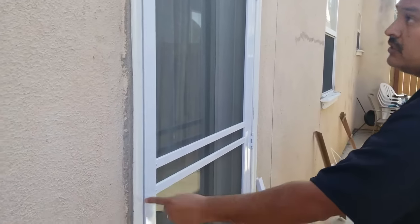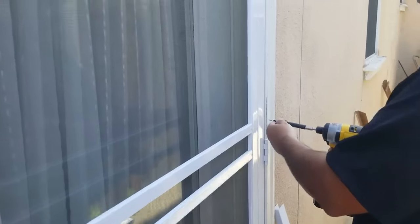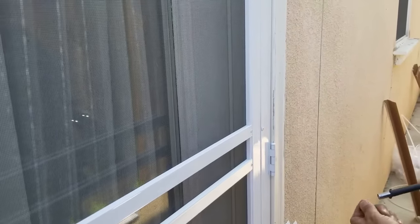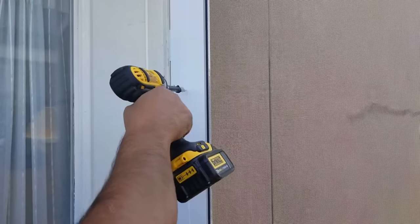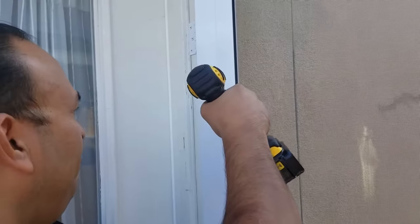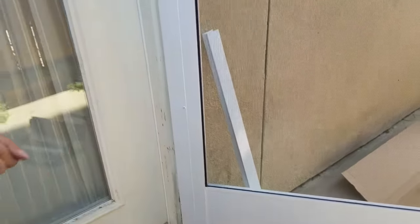As long as it's lined up here on the side — just remember the wood sometimes, the molding on the side, sometimes it's going to be bowing, so you've got to get it just right so that way it fits in there well. Let's go ahead and run these screws. I'm going to do one on the outside and then a couple on the inside. I don't want to do too much at first — you want to make sure everything's working, and I'll go back and usually add screws later just to be safe. That's it with the screws.